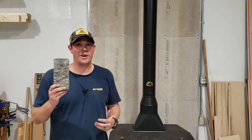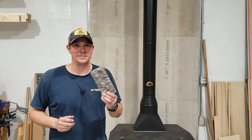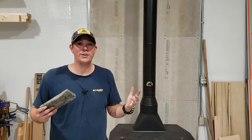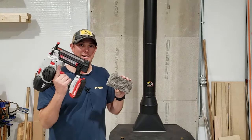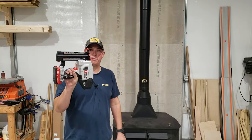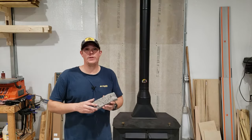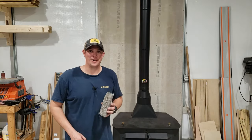What's really great about this stuff is not just how light and easy to handle it is — it's also how easy it is to install. The only thing you're going to need is a nail gun. This is a cordless 18-gauge brad nailer from Porter Cable, but really any brad nailer or finish nailer will get the job done. We're going to be using two-inch brad nails to fasten these to the wall. Now let's get started.